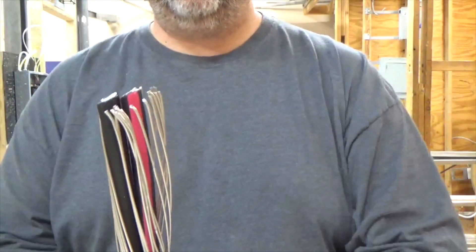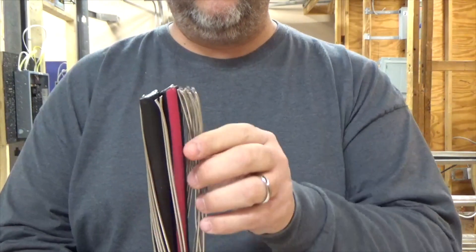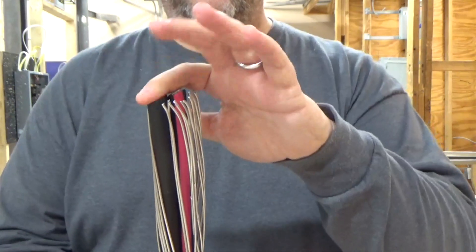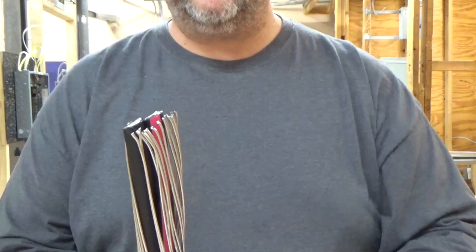As I stated before, you're going to have these wires here — we're going to twist them and make our own neutral. Then we have our insulated conductors, and those are also going to fit in our weather head. Let's look at the weather head.